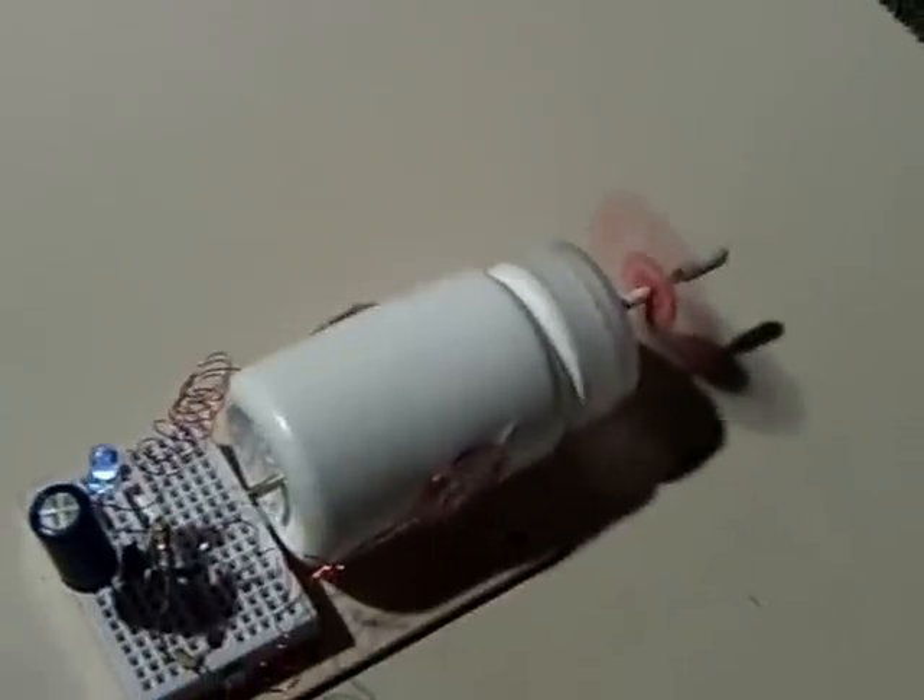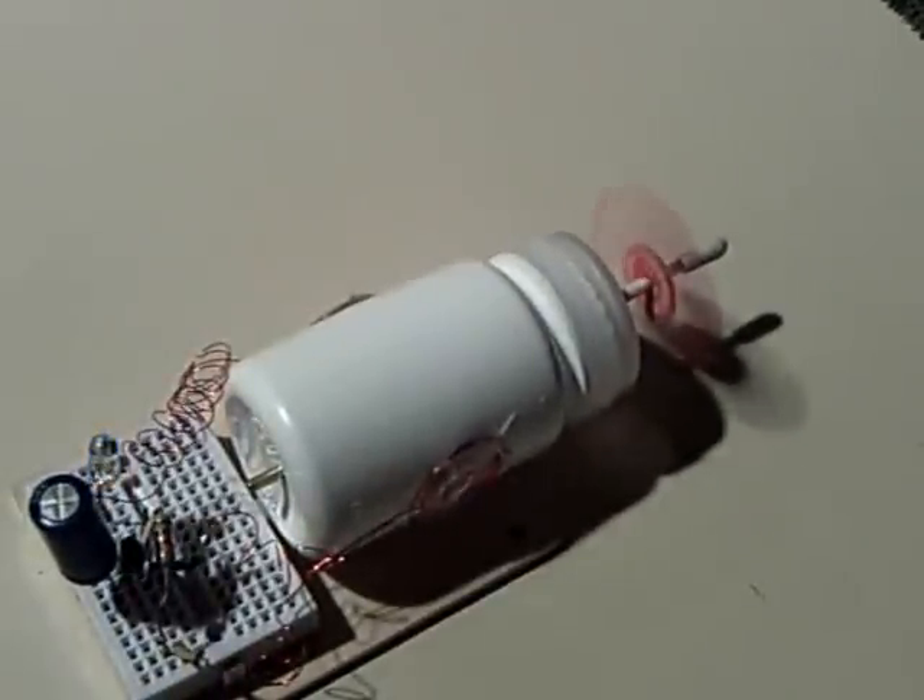There we go in the dark to see the LED a little bit better. The LED goes from the collector to the positive feed on this setup — you can go anywhere you want to with it. It's the inductive kickback, and I'm feeding this little super capacitor, which is a 2.7-volt cap at about 2.5 volts. Anyway, that's the latest for this little pill bottle motor.